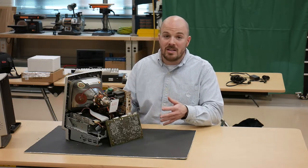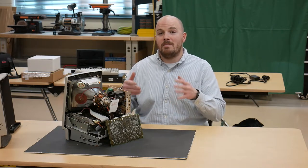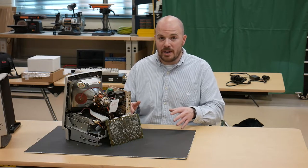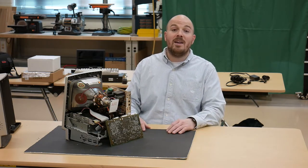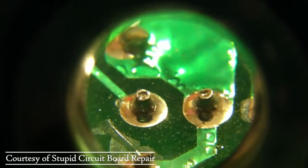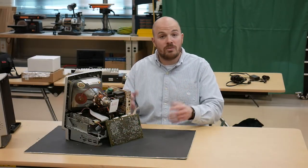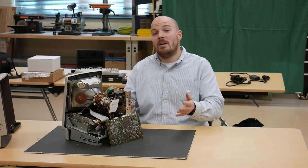As far as I can tell, there are no dry solder joints on this logic board, which probably has a lot to do with the fact that Apple used modern robotic techniques when manufacturing their logic boards. The analog boards, however, are a different story — they were contracted out to other companies that focused on CRTs. If you have any experience with arcade tech, you know arcade monitors are notorious for dry solder joints, especially Wells Gardner units. That's something we'll have to look at later in this build.